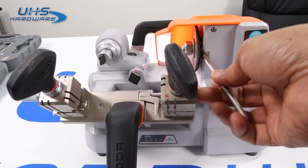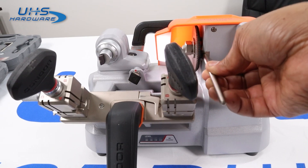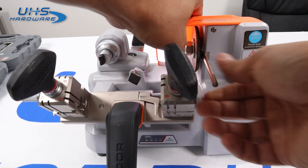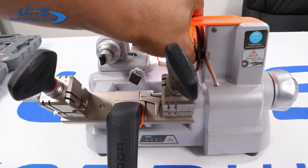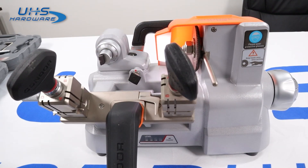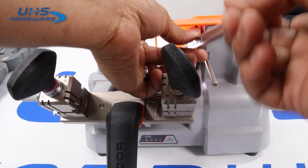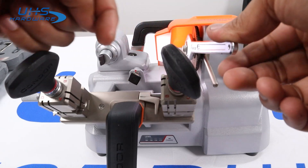Let me demonstrate the blade stop right now. Right inside here, next to the blade, there's a little slot where this piece goes. You just turn the blade a little bit until it slides all the way in, and then the blade is no longer mobile. This gives you the ability to use the wrench to go in and loosen up that bolt, allowing you to take the blade off.